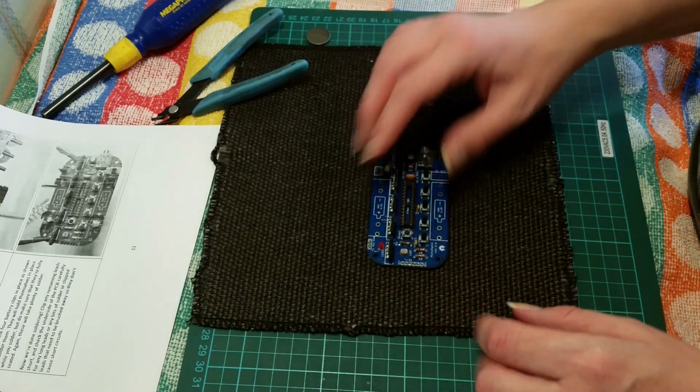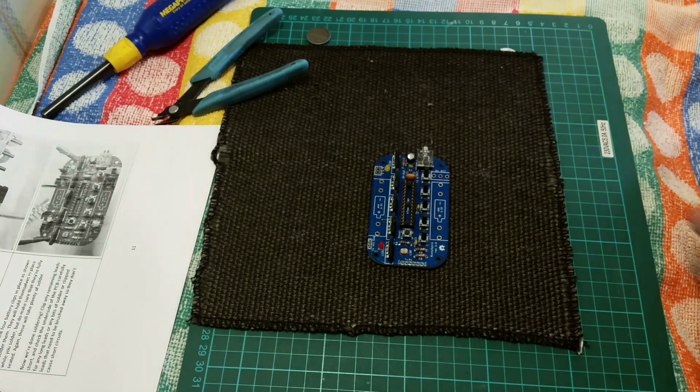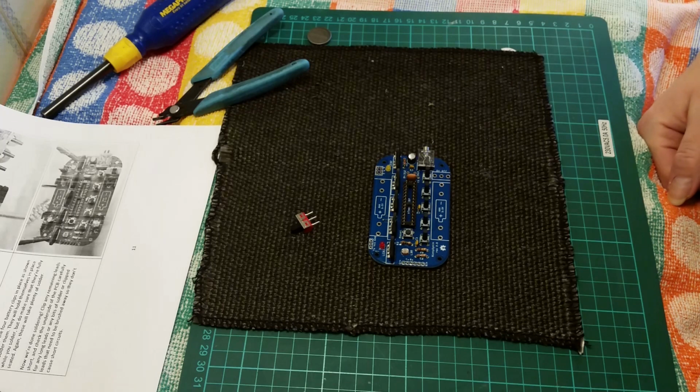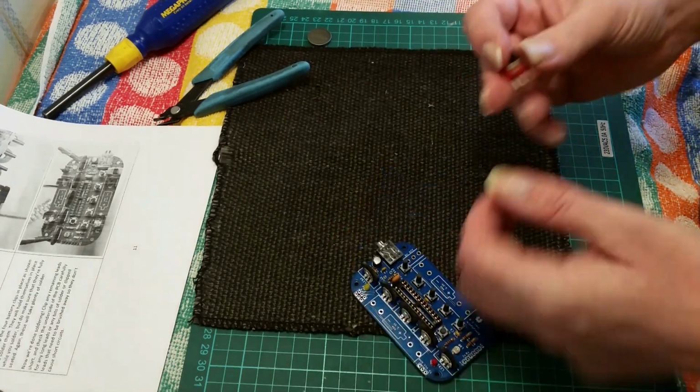So moving on. When it's installed the power switch, let's find the power switch. There we go. It doesn't matter which way round. There's another case that can be a little tricky to keep fully seated and vertical while you solder. So take your time and use some means of holding it in place. Be generous with solder here too. So the switch.